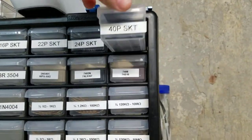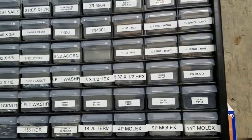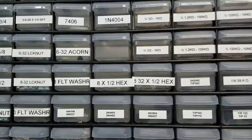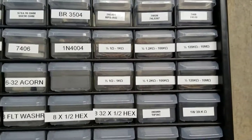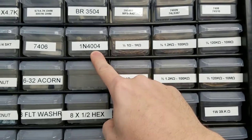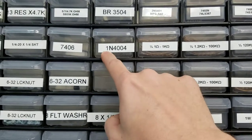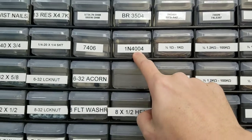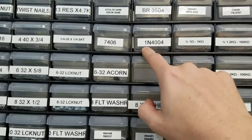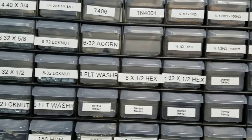Also really important in this top level is electrical components. One thing you really want to pick up is diodes — I use 1N4004s. You also see 1N4001s; the 4004s are a slightly higher voltage but are a direct replacement for 4001s and can take a little bit more. Feel free to just use those.